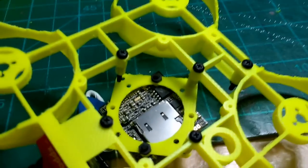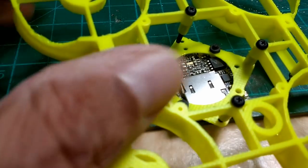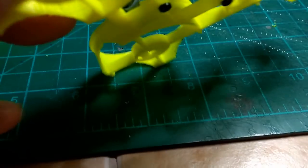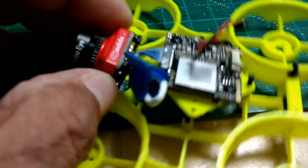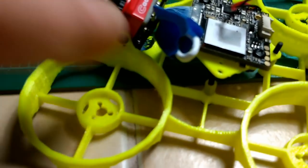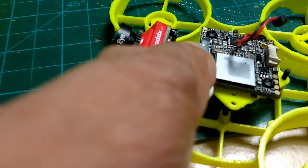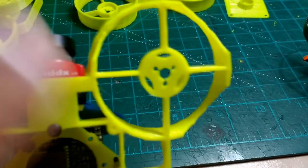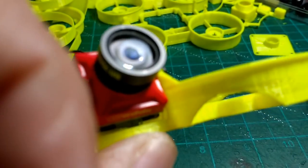I added a very thin plate — about 0.4 millimeters thick — to protect the wires for the Caddx camera. You can see those wires bend underneath; the way this camera sits, the wires come from underneath and wrap around to plug into the board. So if you land hard or catch a twig, I don't want those wires getting caught. With this protection plate they're well protected.